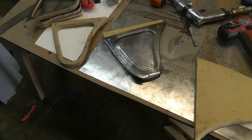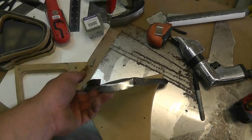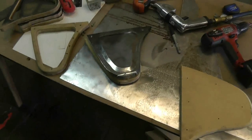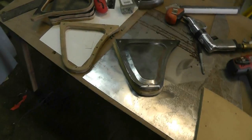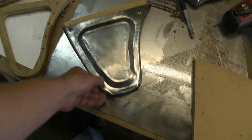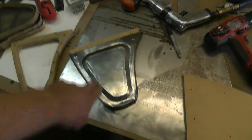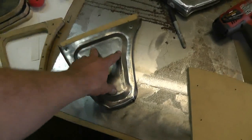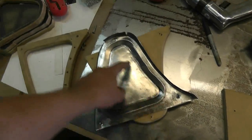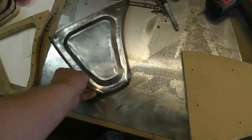I'm trying to figure out what I'm gonna do. This bead is only a quarter inch deep and the original is half an inch deep. I thought about turning out a couple of new rollers on the lathe but I didn't have any stock — I found two-inch aluminum but not steel and that just won't cut it. So I'll probably play around with this some more, maybe hammer and dolly it. This side doesn't matter because it's inside the car, but the other side — I'm not exactly happy with this corner no matter how much pounding I did.